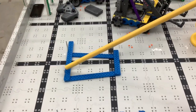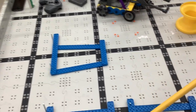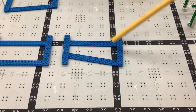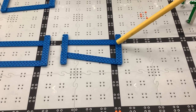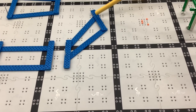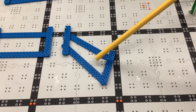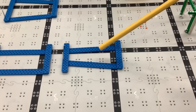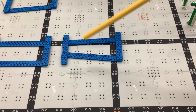That's when it's wider at the base than at the claw end. Now let's take the opposite — it's closer together on the robot end and wider out at the claw. Now as we move up it tilts upward, and when we move downward it tilts down. Our team actually used that this year in our design on purpose, and we're going to show you why that worked to our advantage.